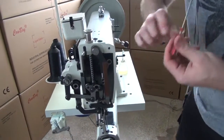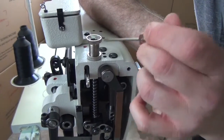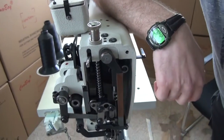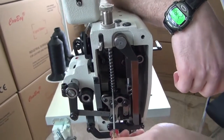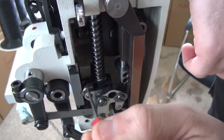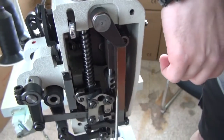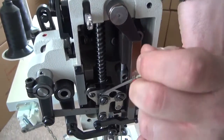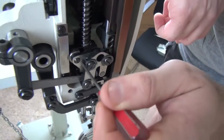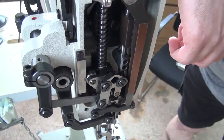There are lubrication points inside the sewing machine. I like to put a few drops of oil on the threaded rod that controls the presser foot tension, as well as in the hole where the presser foot bar goes up and down. I also put a few drops of oil along this spring so that it slides up and down smoothly against the presser foot bar. I put a few drops on this wheel assembly, and a few drops back behind here where the block assembly fits into the casting housing. On these pieces there are small holes here, here, and here — I put a few drops in those holes as well as a little bit of oil where this bell crank rides against the front casting on the sewing machine.